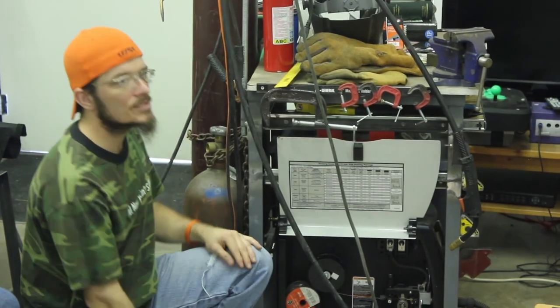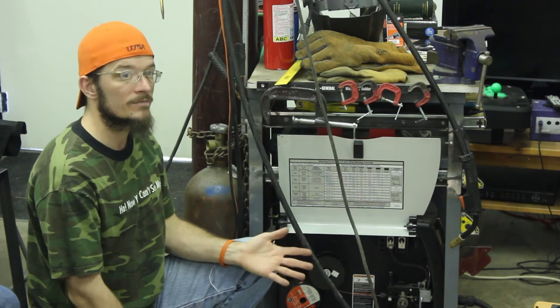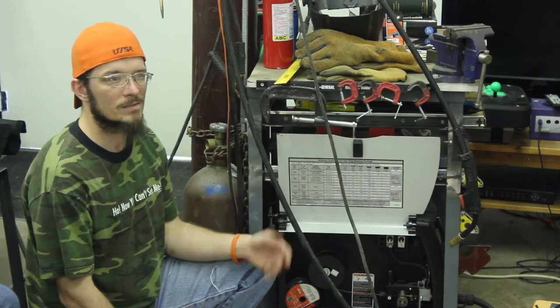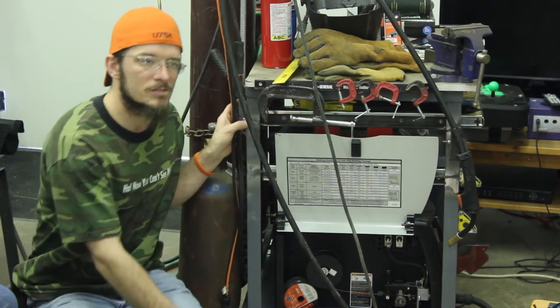I was going to get the 240, and it's not that hard to do 240. Three phase is tricky. You can't even get that in a residential area. Right. But 240 is nothing to be afraid of. I mean, it's just $30. Well, I've got two phase at my house. Right. You just need two legs of the 240 that they send to your house.